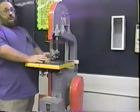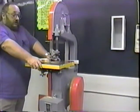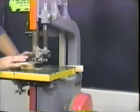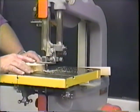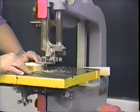You have to concentrate on it, whether you use this machine for 1 day or 100 days, because you don't want to get cut. Never put your fingers in there when this blade is running or coasting, and if there's any problems, assuming you haven't cut yourself, you turn it off immediately, then you see me. And again, remember my guidelines on cutting round stock. We generally don't do it. If you feel you need to, you've got to see me. We'll take it on a case-by-case basis to be able to do it.